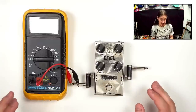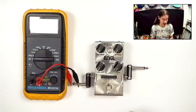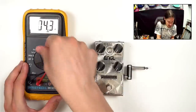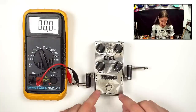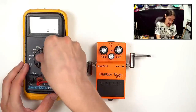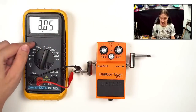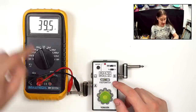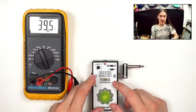Finally, to prove our expectations, I will measure the capacitance between the tip and the ground of the output when the pedal is disengaged. There will be some capacitance, but it shouldn't be higher than just a few picofarads — so when I set the device to this position it should read zero. Together with the previous measurements, this zero reading confirms that this is indeed a true bypass pedal. With an active or buffered bypass you're not going to get a zero reading here. In fact, the capacitance is pretty high, as it is with this pedal and this one. And here again is the pedal with the suspicious passive bypass — the capacitance is pretty far from zero, so even though it is passive it is definitely not true bypass.